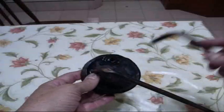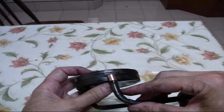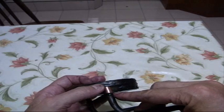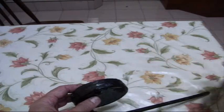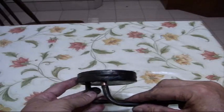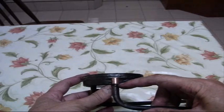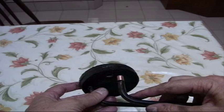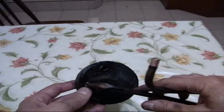I've got a couple of theories on why it's not working properly. The tubes were too far up inside the boiler — if it inhales too much water, it can't blow the water back out and has to wait until the water boils away as steam, which takes a long time. Also, the big tubes allow it to suck up too much water — basically it floods. Construction note: make the tubes as short as possible and make sure there's a way for the water to get out. Maybe with a tube this big, I only need one tube.